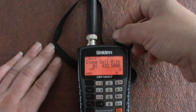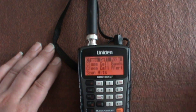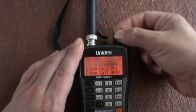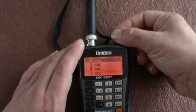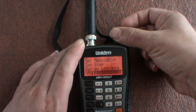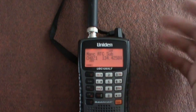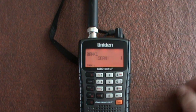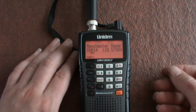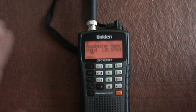You can store it in the bank at the end — pretty simple. Let's unhold that. To get rid of the CTCSS function: press function then the hold button, then you can switch it all off. Scan hits — you can leave them on, it's entirely up to you. I'll usually only have it on when I'm out and about working nights. Someone also asked about turning the beep sound off: function then seven.